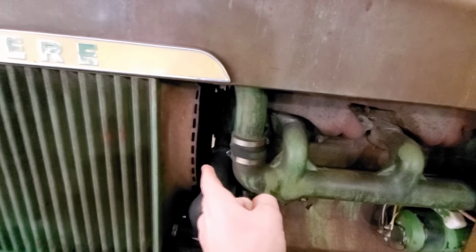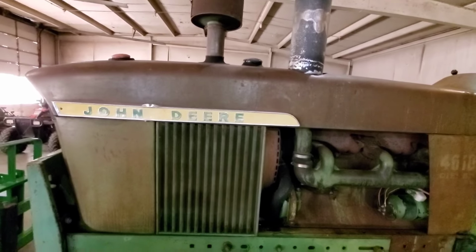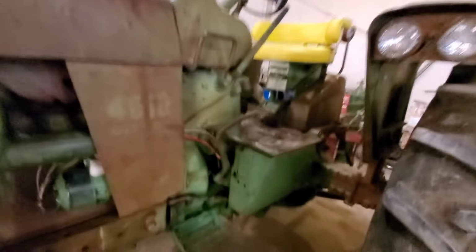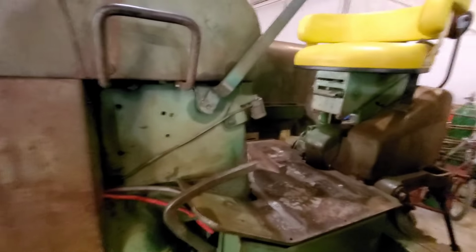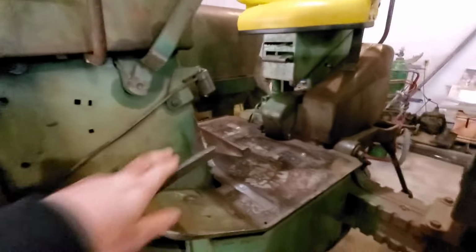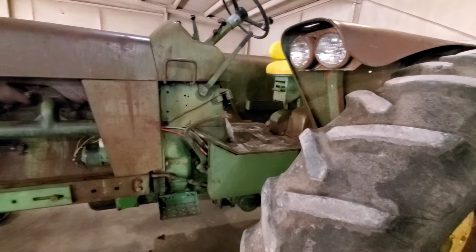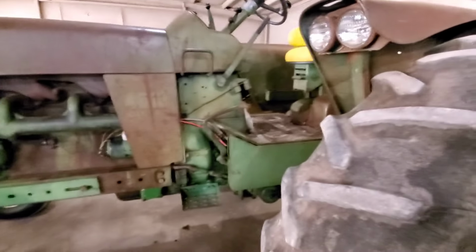So if this cylinder to lift the loader takes a gallon, and you only have a gallon, by the time that thing reaches top stroke, you're out of oil. That's why when you go to lift the loader with a synchro range tractor, you'll start to have a lot of chattering. Now on the power shift, the transmission and the scavenge pump and everything runs 100% of the time, and even if you push the clutch pedal, this scavenge pump will always be running, and the clutch pedal is actually just a hydraulic valve that does nothing more than separate the clutch packs in there, which is what would act as clutching the tractor.